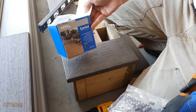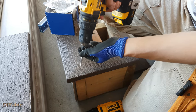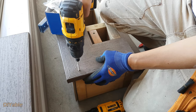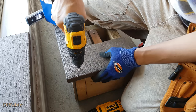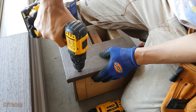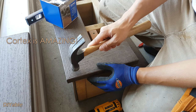I am using the color-matching Cortex system. It has stainless steel screws and plastic plugs matching the deck color and texture. It's amazing — after you put the plugs on, you don't really see the screws. It comes with a special drill bit that leaves some space for the plastic plug, and you then use a hammer to install the plug. Amazing — the screw is totally hidden.